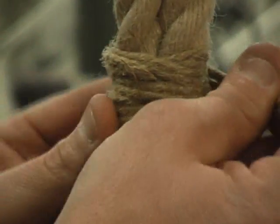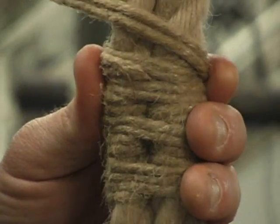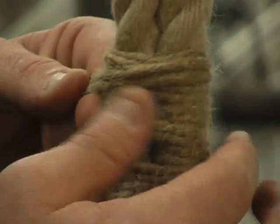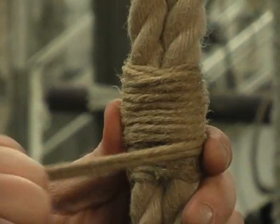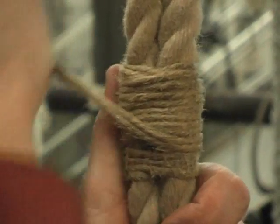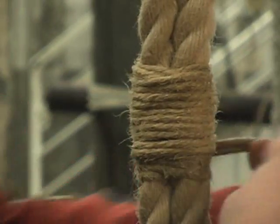and then kind of squeeze that up, making sure that this first wrap is being wrapped, I think it was too tight for me to spin it around, but is being wrapped so it's not riding up over top of the seizing. It's just below the last turn. And every now and again I'll kind of lever it against the edge of the last turn and work the tension up a little bit.